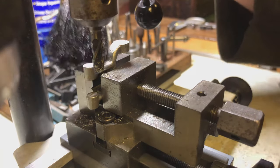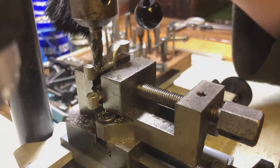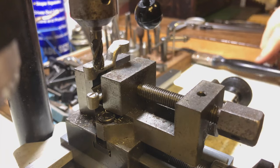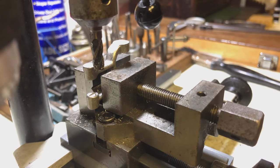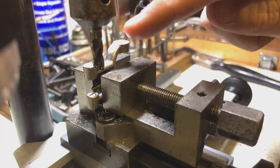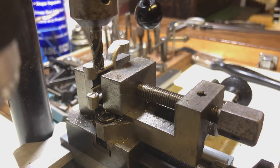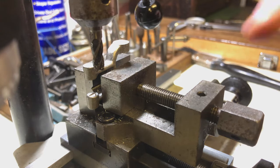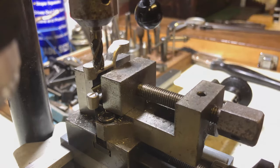That cleaned up beautifully — that's nice. I was able to do that in one depth all the way across. That is beautifully tidied up. And now I know that these two faces are completely on the same plane as each other, so if I ever need to reference them for anything I know they are both in the same plane, just at different heights. That's a big thumbs up — lovely.